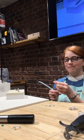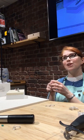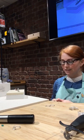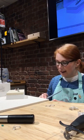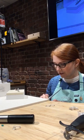So with solder, can you see it's a bit yellow? Tarnished, really. You want clean solder too, you don't want just clean metal. A good way to do that is to use the side of your snips and scrape your solder clean.